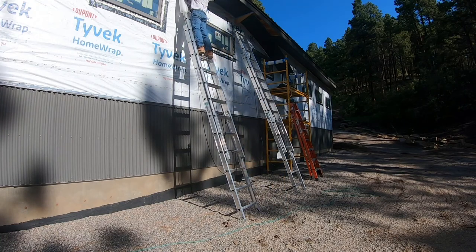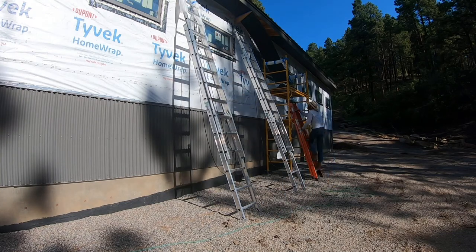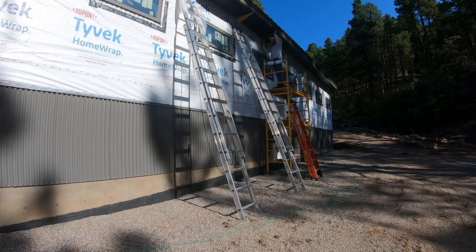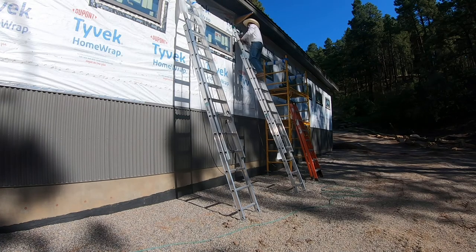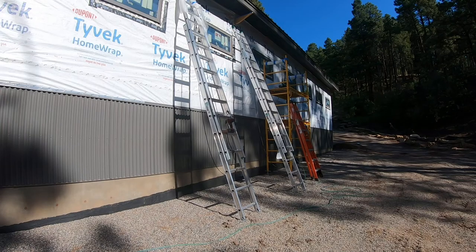The back of the garage is angled, so it's a little tricky. I figured out that once I get the piece where it needs to be, I can put some little blocks underneath on the wall side, wedge the material up, then put a screw in it, and go down the line to make sure it fits really nice. In order to get the seams lined up, before I start nailing, I use these little blocks. Because it's a sloped roof, I put the blocks up high, and that keeps all the soffit material flush with the framing on top, which lines up the seam a lot better.